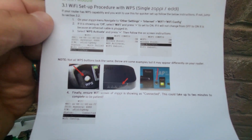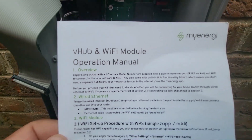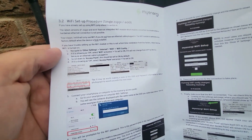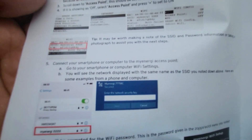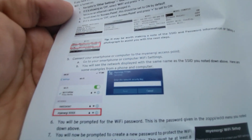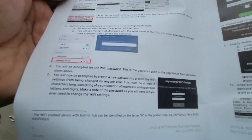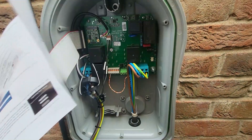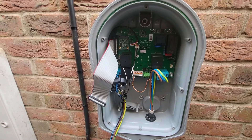Just to emphasize - if you're ordering these, it needs an H in the model number to have that Wi-Fi connection. If you're not using a WPS button it gives you a full set of instructions: you navigate to the Wi-Fi config, find the wireless network it's trying to connect to, and input the password using the MyEnergi access point. You would connect to your MyEnergi network and input all the details and it walks you through step by step. We're hoping we don't need to do that because we have a WPS button and it sounds a lot simpler.